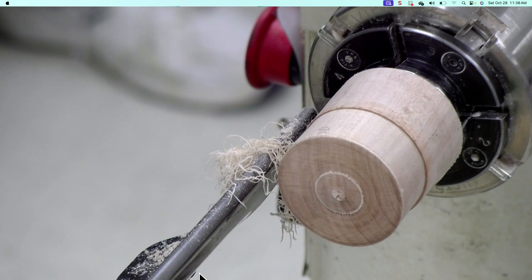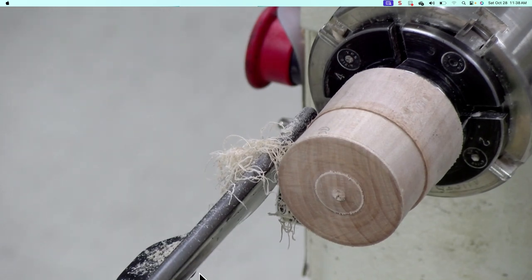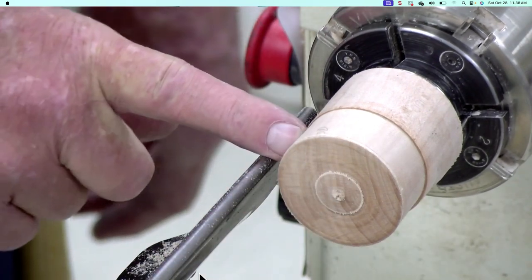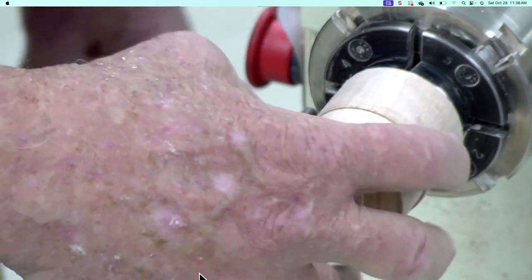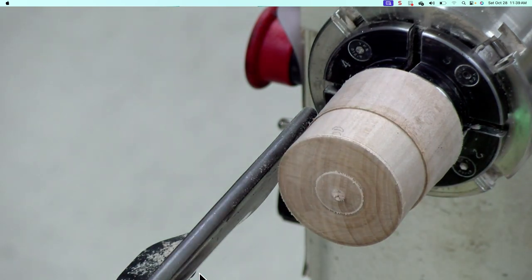It looks like we're right on time. Now, let me just recap something. First of all, the woods. You may not go into all those eight woods that I described earlier just because they're expensive and hard to come by. But they're the alternative woods, and there's alternative practice material you can go home and play with. The other thing is when you come in, you want to soften the entry. I soften it with a roundover. And then you want to put the recess back in there to make sure you have time to pull out before it hits the shoulder. And when you have to reduce the size of the male, or increase the size of the female, you do it with something like this, not with a thread chaser.